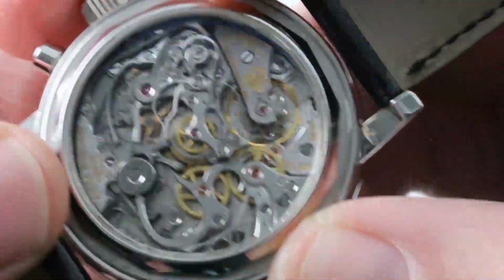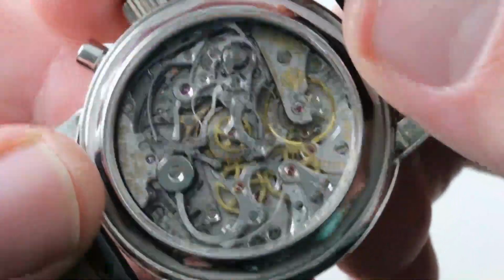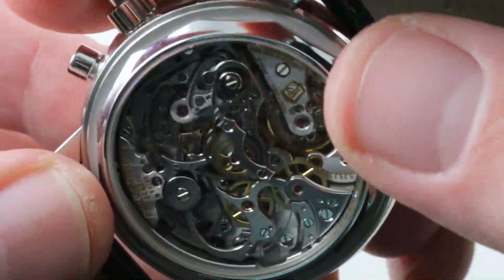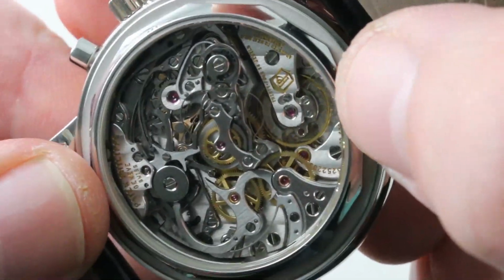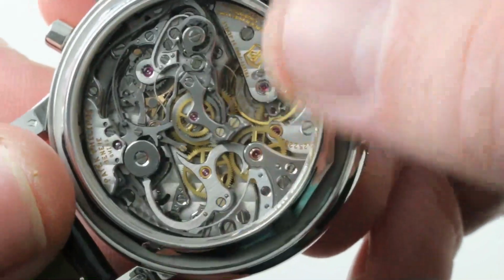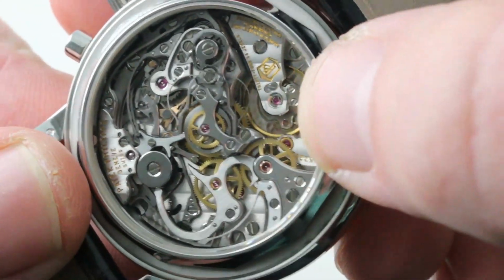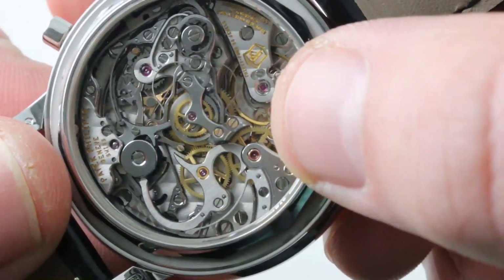As I move the watch with respect to camera, you can see everything that is black polished turning black. That is the highest standard of optical finish. You'll also note, as I turn it flush to the camera, the edges of all of the levers and all of the bridges glow and gleam. That is that mirrored, optically smooth anglage, laid down and rounded, a chamfering done by hand with diminishing gradient of tools to achieve that mirrored surface.